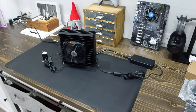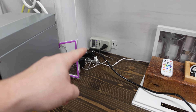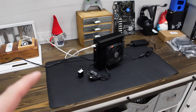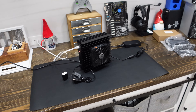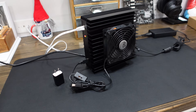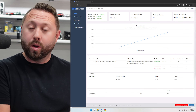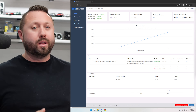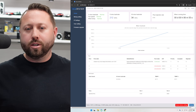Let's check the watts real quick — 98 watts on our watt meter. Let's jump over to the computer and dive in step by step at getting this thing overclocked. I've now swapped out my 120 watt power supply for the 230 watt power supply. In the software — it's only been up about six minutes — we're at 212 gigahash, so no real big change yet.